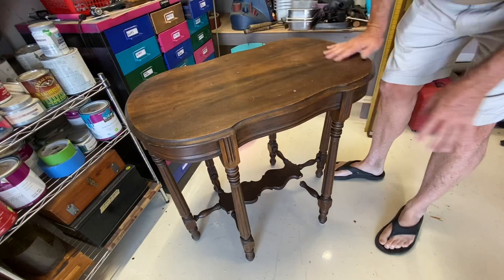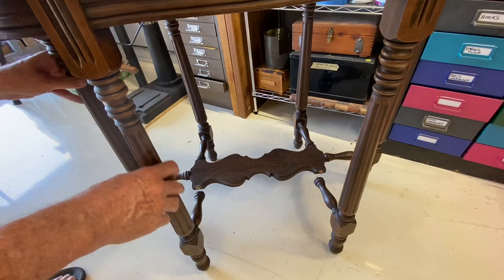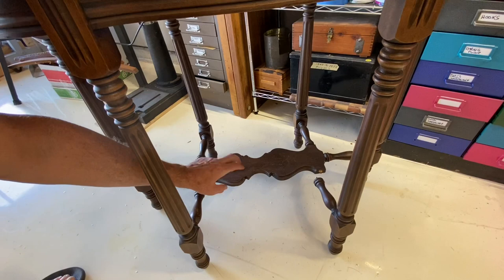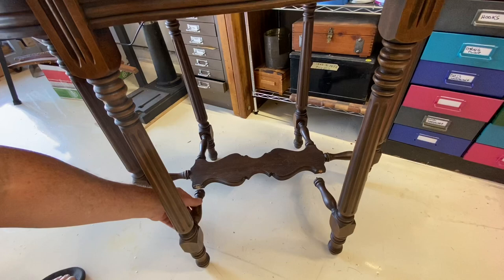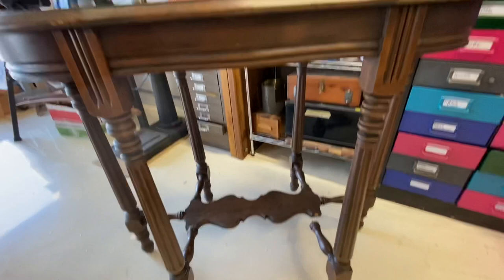The legs at the bottom are tied together by this little piece down here — I wouldn't quite call it a shelf. All the legs are a little bit loose and two of them are broken. It almost looks like somebody tried to put their foot there, and there's some dog chewing on this particular spindle. We're going to see if we can repair these; if necessary I'll turn new ones, but I hope to reuse them. We'll have to take the top off, get the legs loose, and re-glue everything.